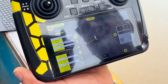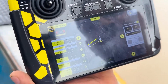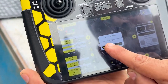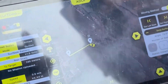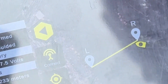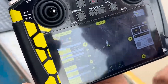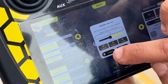The left-to-right bank transect is now almost completed, and I want to complete the transect from right bank to left bank. It's so easy — I'll click on the left bank and send the instruction to the boat: go to the left bank, confirm. You can see the boat is turning towards the left bank where we have marked. The boat has started now at 0.8 meters per second. I can increase or decrease the speed based on water velocity, so I'll set it to 1.9 meters per second and confirm.